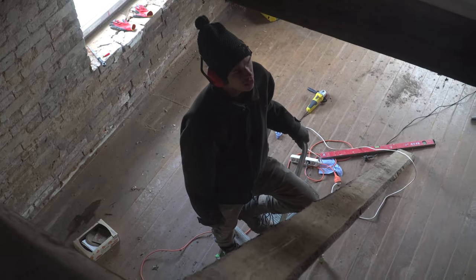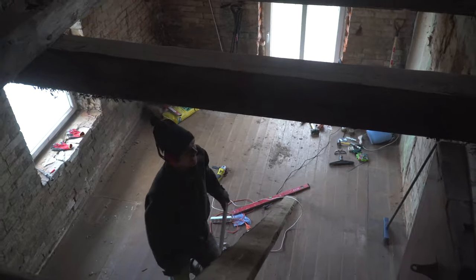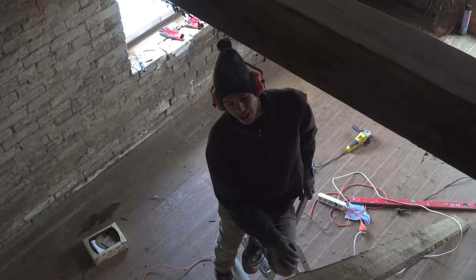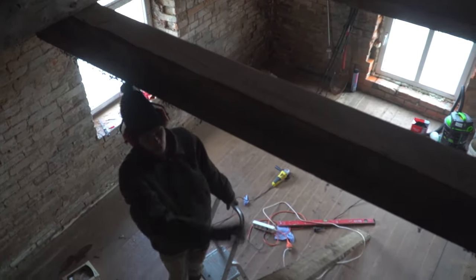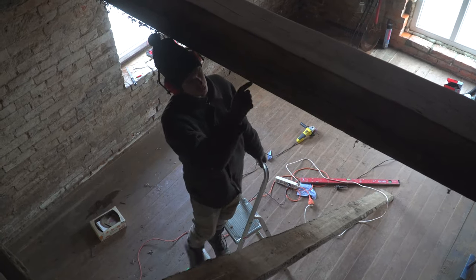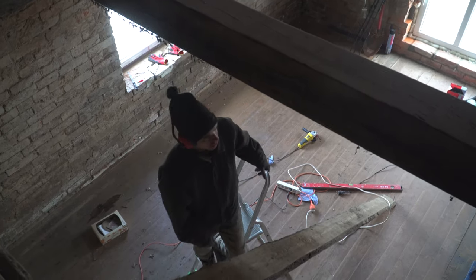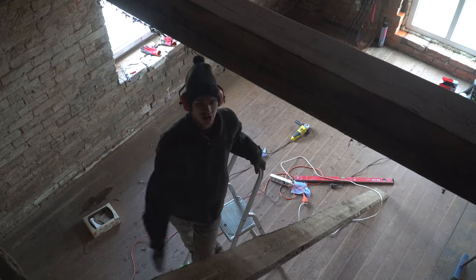So the plan now is to put some stickies here. Yeah, that's it. So I'm cleaning up the woods, not these ones particularly, but I'm doing first of all these ones. I need to attach this wood here to hold the ceiling up, to be something to screw into, because we don't have corners to screw into, like metal ones like you use in modern style houses, but I'll just use a traditional way with wood, much nicer as well.